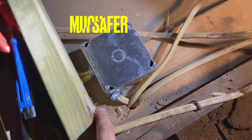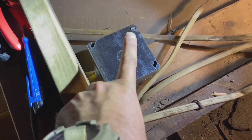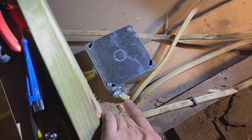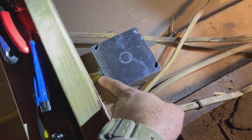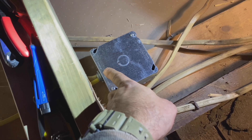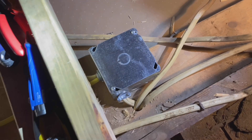You can see now, this is a safe box. It has a lid on it with two screws securing that lid. We have our clamps — our clamps are tightened down on the wires so that they can't pull out, they can't slide in or go out. I put two wires inside one clamp and tightened them down from the inside. Make sure you can get to your screws so that you can tighten it down without trouble or having to remove the box.